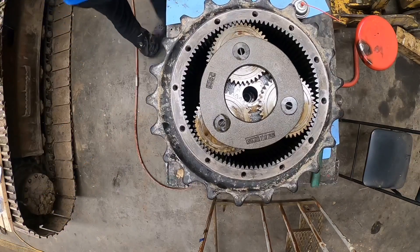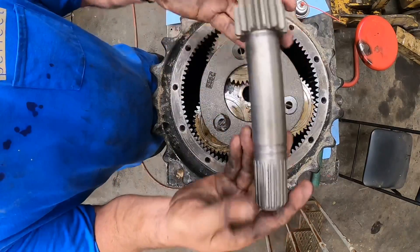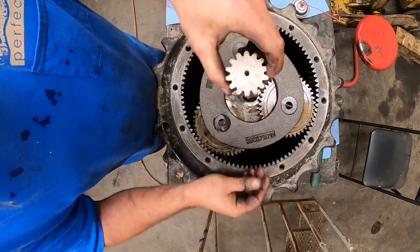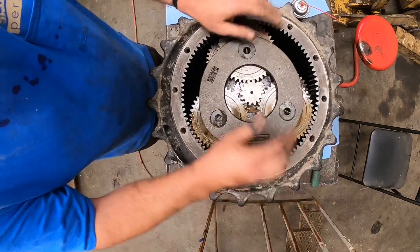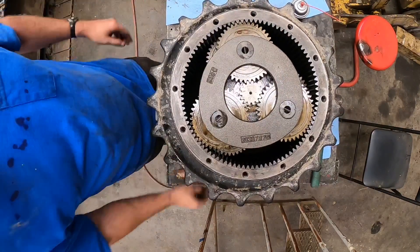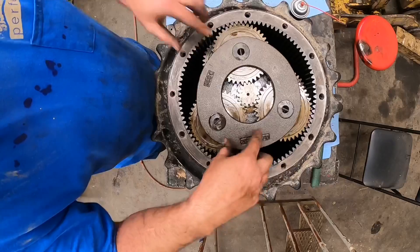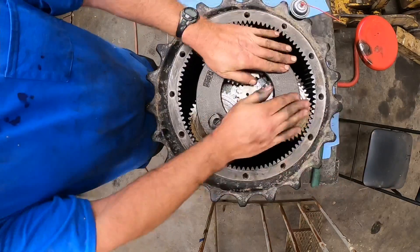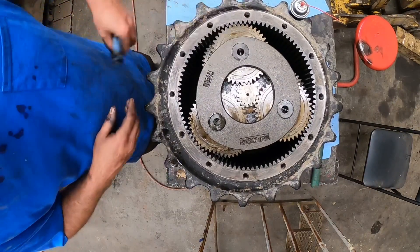There's one last piece to go in here - that's our new drive gear. This is the splines that were stripped out, and if you guys can see all the way down that hole, that's the new shaft we installed in the pump. So this is what turns it all. That'll slide down in there, there's a thrust washer in there. Get everything lined up just right and it should fall right down in there. There it is - now look, it's locked up, won't turn no more. So the pump turns that, that turns these, which in turn turns these, which turns that piece down between, which turns the whole kit and caboodle. The only thing left on this is to install the cover, put oil in it, and install her back on the machine.